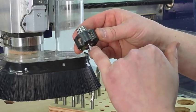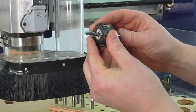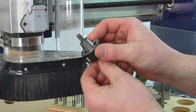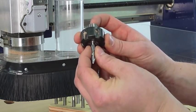A rule of thumb is to push it in all the way to just about where the cutter starts. When you reach that actual cutting surface and push it up in there, that could damage the cutting surface, so you want to back it out a little bit. But you also want to make sure this isn't sticking out too far on the backside, or it could bottom out inside the spindle or router.